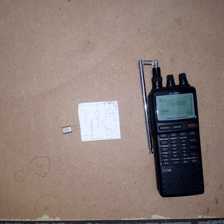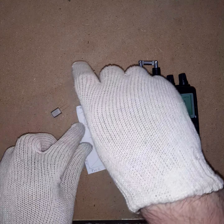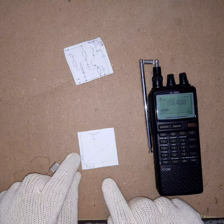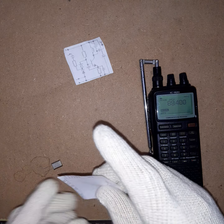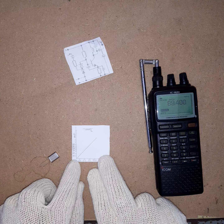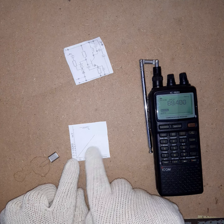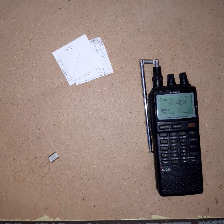But there is something about coils. Coils are frequency related. That means if you have a coil and you add a frequency, the resistance of the coil, the AC resistance, is going to be different. I have a drawing here. So you have a coil and you add a frequency, and you can see the higher the frequency gets, the more voltage you have on the coil. I have also numbers here. You start with 30 megahertz and you get around 10 millivolts, and then you go up to the FM band like 100 megahertz and you have 50 millivolts, 5 times more voltage on the coil than on the lower frequency. Based on this so-called high-pass filter, you can build your transmitter.